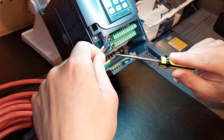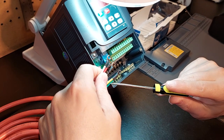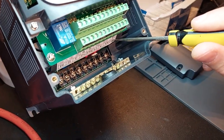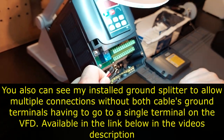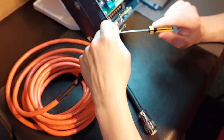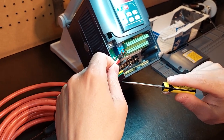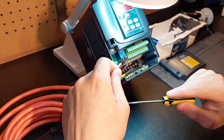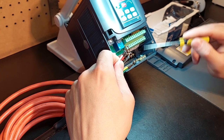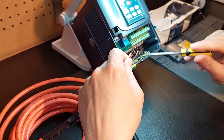This final lead is the most critical lead — I'll say it again, this is the most critical lead not to screw up. The lead that has two leads coming into it goes to terminal nine where the actual ground symbol is. One is the yellow with green stripe from the connector's pin number four — the unit's ground. The one next to it is a silicone extension of the shield drain from your tin-braided copper shielding as well as your mylar foil shielding on your double-shielded cable. You should not be using a single-shielded cable with any VFD spindle application — it is not best practice, and the potential for EMI interference is massive.